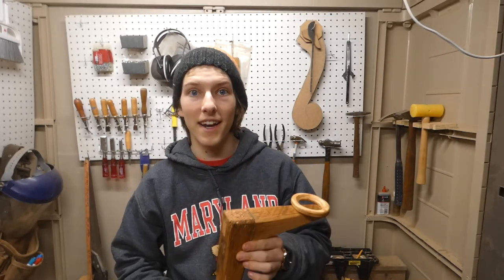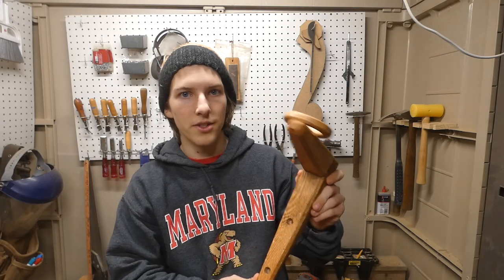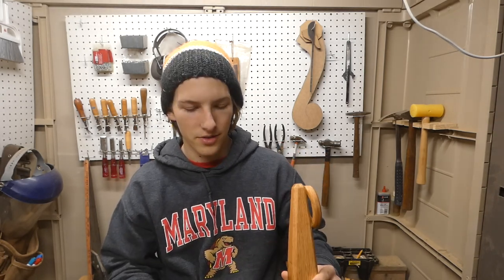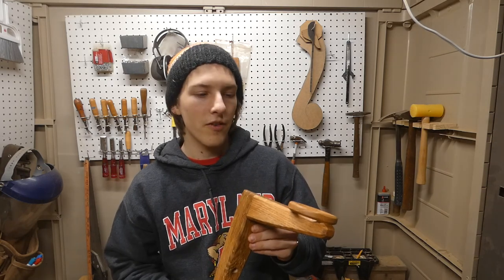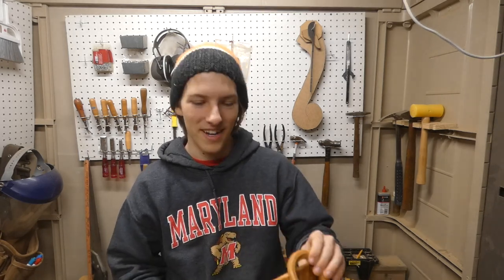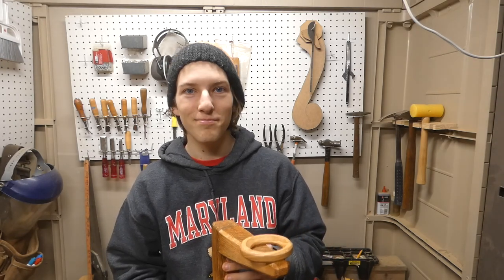Well, this is the finished piece — I'm pretty proud of it and I think it will look great in her room. I cannot wait to see it up on the wall with a ball on it. I drilled two holes at the bottom because the easiest way to install it would be to drill two screws connecting this piece to the stud, though there are probably other ways to fasten it. I could plug the screws with something, but right now it is 7:40 on Christmas Eve and I'm not feeling like making plugs. I tried to make it something that was easy to duplicate out of the stock I have, because she may want another one or a third to really make a collection — three of these all in a row with three balls on it, yeah, that'd be nice. I hope you are inspired by what I made to design your own or copy what I just did. Good luck, bye.